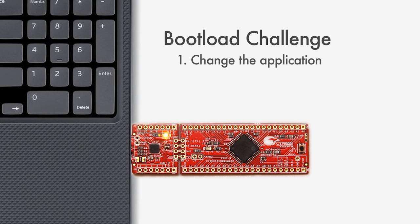Give this a try for yourself by changing the application and bootloading your update. Change the blinking speed of the LED, vary the on and off times from the firmware. It doesn't really matter what you make the application do — you're just getting used to the bootloading process and building bootloadable applications in PSoC Creator and then downloading, also known as bootloading them, from the host utility.